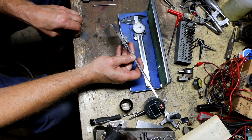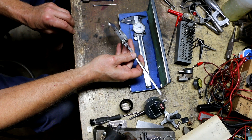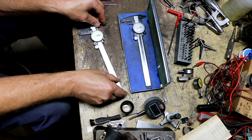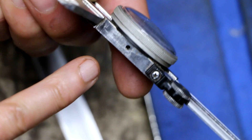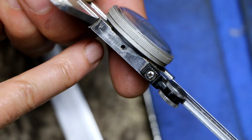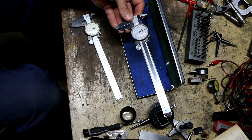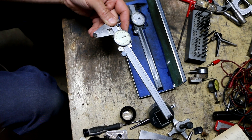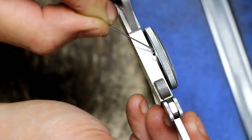What you actually do is use the hole that the thumb screw for the bezel lock threads into. It's important to know what you're dealing with, because the bezel lock hole on this one is actually on the movable jaw — it's not part of the movement. That's why you can't use the pin trick on this one. This other one, even though it's the same exact model number, is constructed quite differently. I've already removed the bezel lock and the hole it went into is hidden right there.